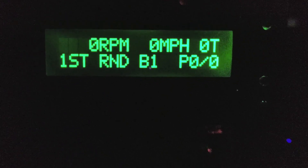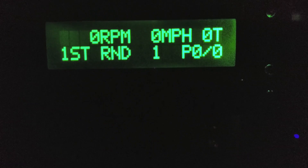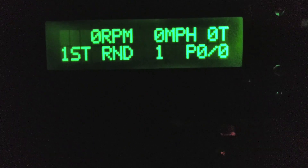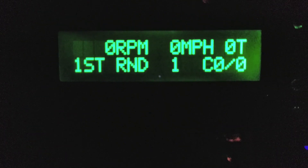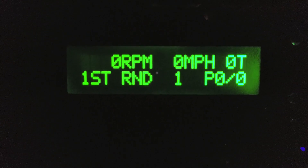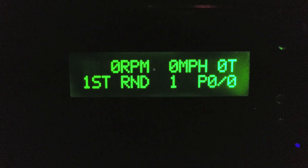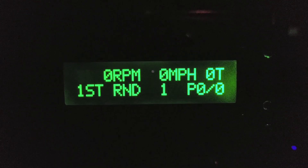The solenoid indicators show up when they activate — solenoid 1, solenoid 2, solenoid 3. The P indicator is for the power-comfort switch — flick it and it goes between comfort and power. The error code IDs: the first is for solenoids, the second for throttle position sensor. That's pretty clean — this is every single bit of info the TCU puts out besides the module ID, which is always 1 and not really useful. Pretty solid — shows you everything you need to know.